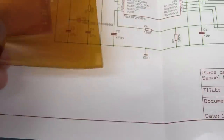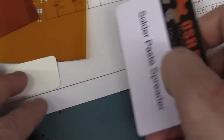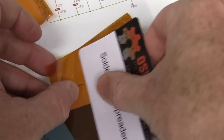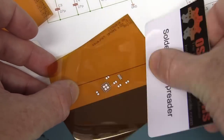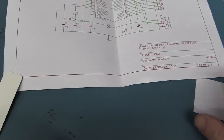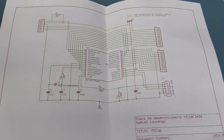Doing SMD stuff yourself is no issue whatsoever. They send a nice little solder paste spreader — you whack this on top of your board, put your paste on there, and go whoop like that. Hopefully you get it in one pass and you've got a reasonable amount of paste in there. It's not as controlled as a real proper high-quality stainless steel stencil, but it's dirt cheap and great for short runs up to the tens or maybe even hundreds. If you're looking at the thousands, you definitely want a stainless steel stencil.